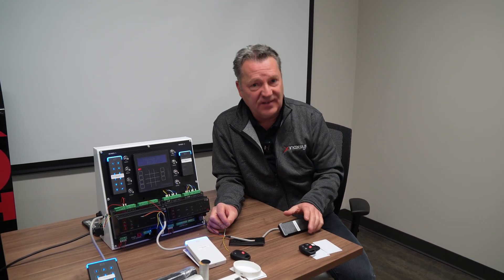A group of companies created a new standard called OSDP — Open Supervised Device Protocol. ICT has taken the OSDP standard and inserted it inside all of their readers. That communication is done over the purple and yellow wires. All ICT readers support both standard Wiegand — which they do not suggest — and also OSDP. Inside ICT, it's called ICT RS-485, because OSDP uses RS-485 as its communication layer.